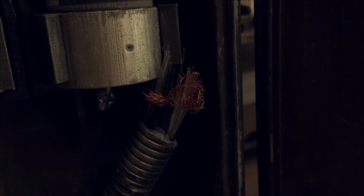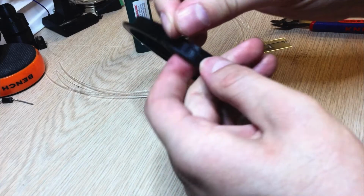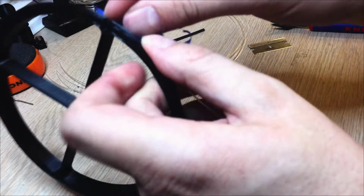Some of the light leaks through the mesh to provide flashing behind the broken fuse, but I wanted to give the illusion of the sparking being much closer to the guest than I could safely put it. So fiber optics are run from LEDs on the control board out to the loose wire end. When you have to perform the same operation many times over, I highly recommend taking the time to create a jig. A small jig created on my 3D printer made quick work of the fiber optic bundles.